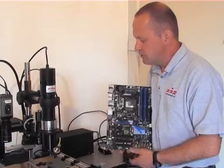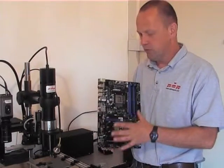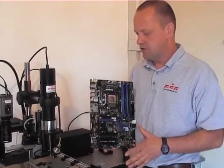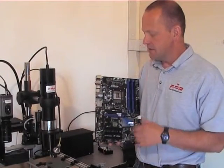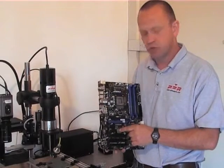What we do is use a large back heater to preheat the board. All that does is negate the heatsink effect of the board and all the other components — it does about 75% of the heating. It also protects the board from delamination and protects the components from thermal shock.